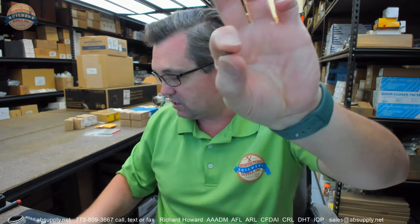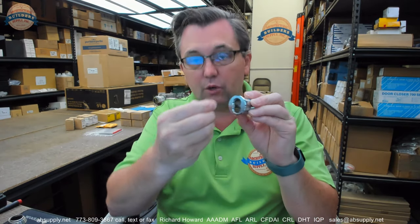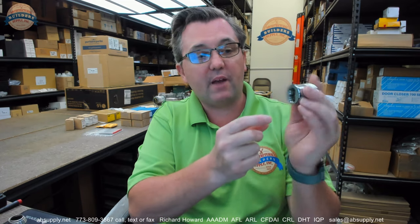This is the one that you'll use — the one with the long tip. The other screw included comes with a spacer. You would drop that spacer into the back in case you were using a shorter, like a 6-pin cylinder, because this housing is appropriate to accommodate a 7-pin length core. So if you're using 6-pin, you'll drop that black disc over the drive member to take up that space behind there.